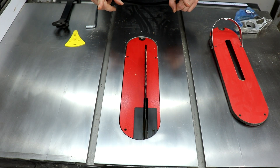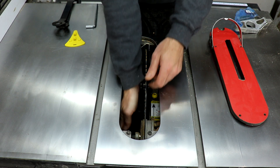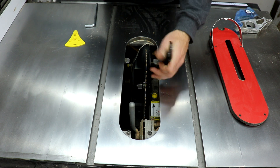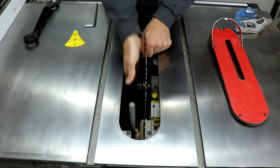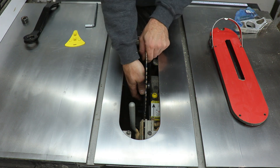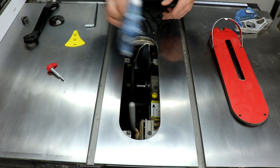I should have mentioned — you definitely want to unplug your saw when doing this. So unplug your saw from the power when you want to switch to a dado stack. You can remove your insert and set it aside, then remove the riving knife and set it aside because you won't be using it for the dado stack. Then get in here, get your blade off — don't cut your hand. Take your nut off, don't drop it — it's not fun to get out, especially if it falls into your dust collection. Get that out, then rotate and pull the pin for the cartridge and get it out of there.